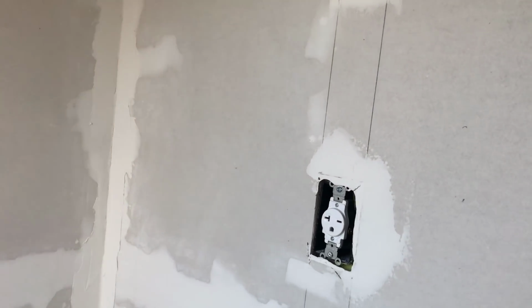Okay, another update. Got drywall up. The mud has been done. One coat of mudding. It's pretty much dry. Look in the corner, maybe a tiny bit, and I've got to go fill the cracks where it dried with one more coat of mud. And yeah, this room is going to be ready to paint, if I want to paint it, put a little floor, and put the AC in.